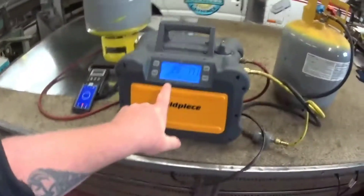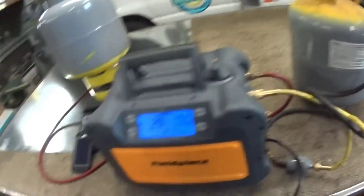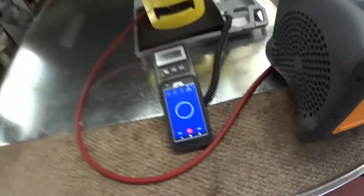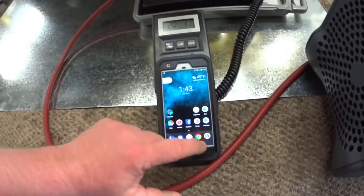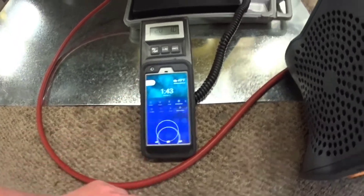We've completed the recovery and the purge process. This one is sucked down to a 29-inch vacuum and the other is sitting with the 20 pounds and whatever ounces - it keeps bouncing between 1.5 and 2 ounces. We are dealing with 7 minutes 38 to 39 seconds total, including the added purge time. So I'm dealing with basically 7:18 of actual recovery - essentially the same amount of recovery time. That is at 65 degrees here in the shop, going right from one bottle to another with no real restrictions.